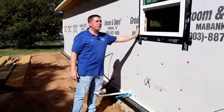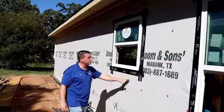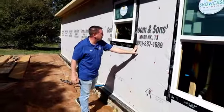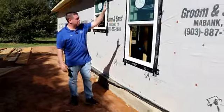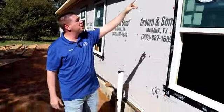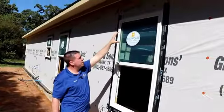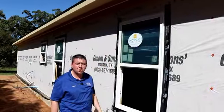You also want to take a good look at your windows, make sure that you've got zip flashing all around your windows, make sure it's overlapping the horizontal joint so you can follow the path of water down. As you can see, this window looks good. As we continue on, we're looking at the exterior wall, and you can notice up here they're actually missing some zip tape, so we want to recommend that they add some zip tape in that area.